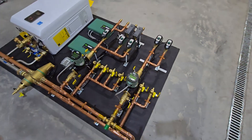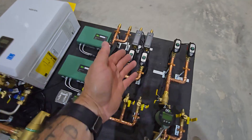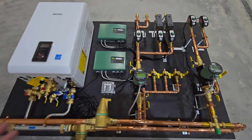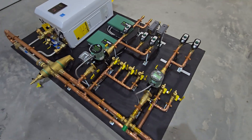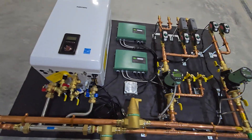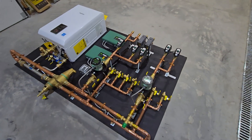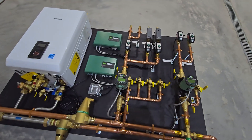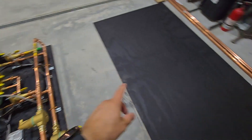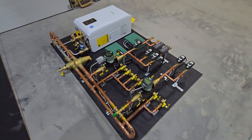This was a pretty fun one — I consider it a challenge because it's different from the norm, but all the components are standard: aquastats, zone valves, circulators — the same things we use for indirect water heaters and heating tanks with boilers, just in a different configuration. We also have purge valves for individually bleeding and purging air out of all the zones, which is another nice add-on. If you have questions about boiler systems or want to see more videos, subscribe — there are plenty more systems to build and videos on the way.